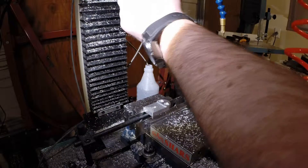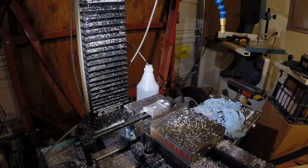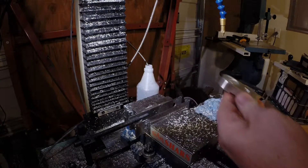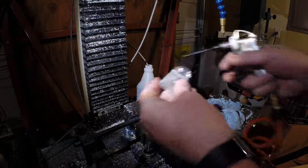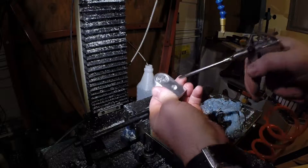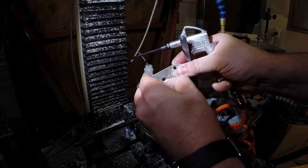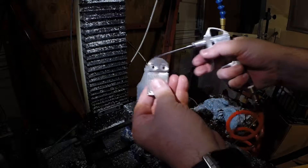That's it. Got to pop the little paper-thin piece of metal out of the bottom of this hole. And there it is — beautiful surface finish. It just needs a little bit of deburring just there and around this edge where we didn't have any chamfers. Other than that, it's ready to go.